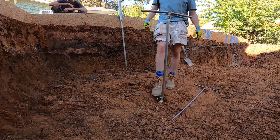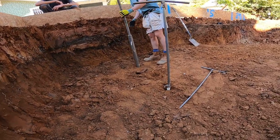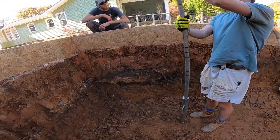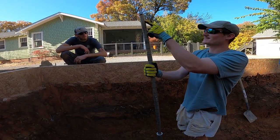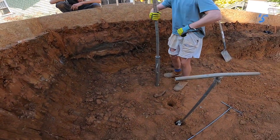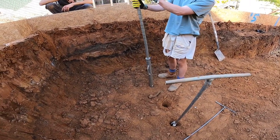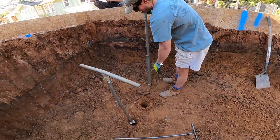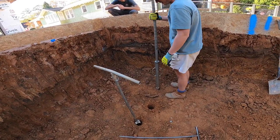You see right here, the roll pin in that. The biggest design flaw on this is that it breaks down into 3 parts, 4 technically, because the tip is put in there with a roll pin. The biggest thing is this roll pin snapping off. If the ground is wetter, I have to beat it up to get it out. And right there, it's welded together. I had one break off there. Sometimes this little thing, which lets you slide the hammer off, is metal on metal constantly beating, so you have to replace some stuff.